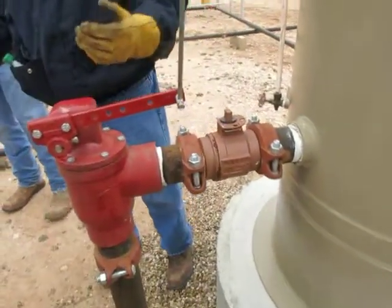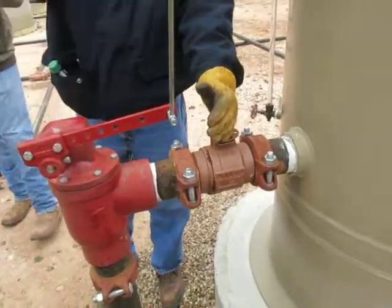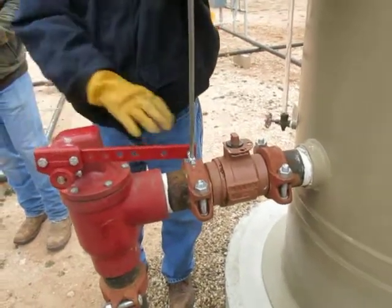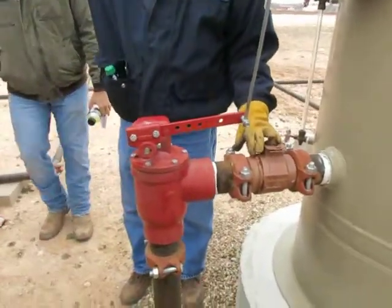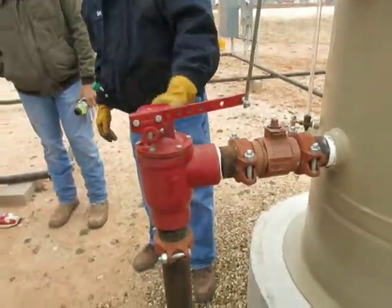You gotta look at the valves. Okay, so this valve is closed, so anything I do here, even though I'm moving that float up and actuating the valve, doesn't do any good. So I've got that pressure trapped. If I had opened this up, it would start equalizing across the other vessels. Okay, so here we've opened up.